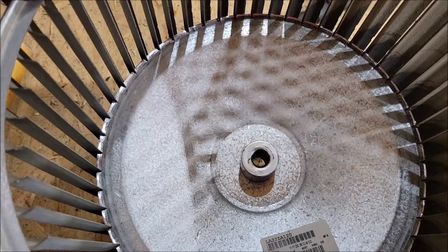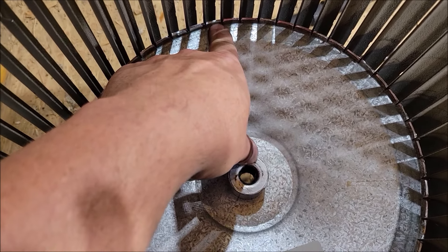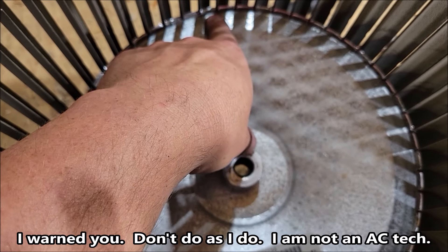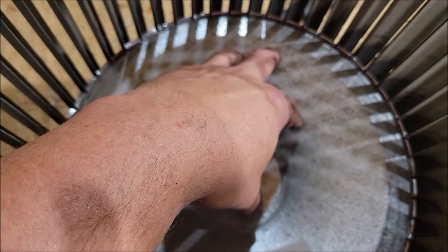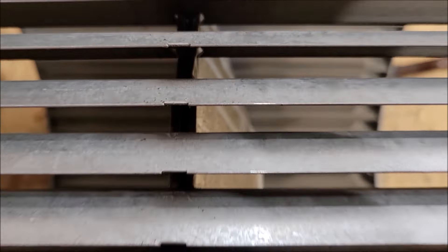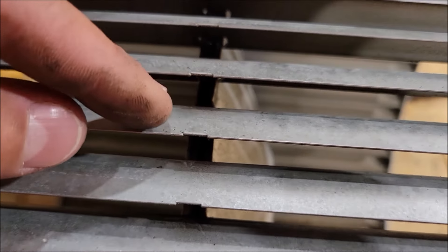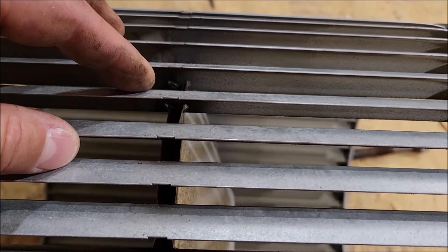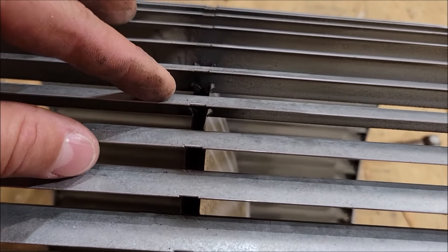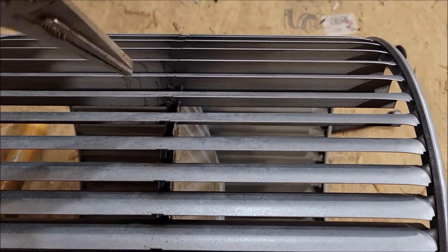This whole thing is turning like I would expect it to turn now. Here's what I did: first I went out on the outside with a flathead screwdriver pushing in on these edges, and that worked but it was kind of a pain. I was worried about throwing off the balance by hitting one side further than the other - the slightest weight difference could really throw this thing off. So what I ended up doing instead - I'll show you here - this is kind of a Y shape, so it's two plates put together with a little Y in it that holds these blades. There's a V shape in the blade that goes along the edges. So instead of the screwdriver, I got a pair of needle-nose vice grips.